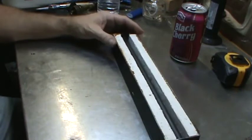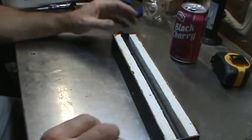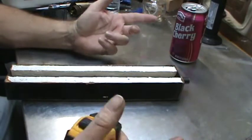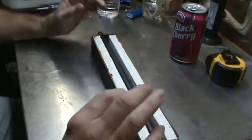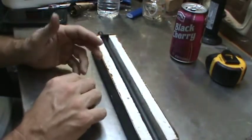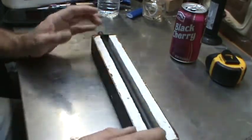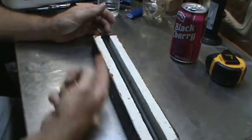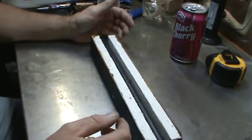The whole purpose behind this, you say, why, is it's going to give us a hollow square. And the square is going to be, in this case, 3/4 of an inch by 3/4 of an inch, I believe, is the outside dimensions with a half-inch hole in the middle of it. The plan is, one, it takes less wax to make one of these, which is always a good thing. And the second reason is by it having that hole up through the middle, when you come along through the pouring cup and force heat, it's going to go up this and it's not having to work to try to melt until it eventually gets to your part.